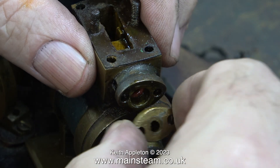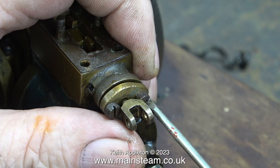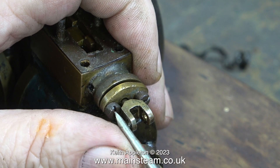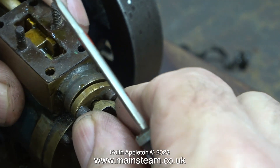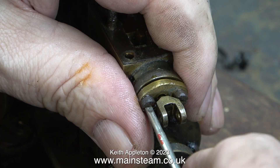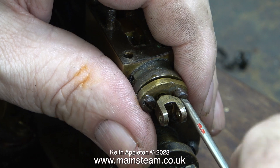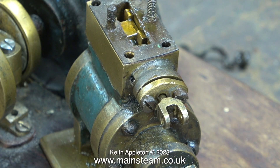As I mentioned in the previous episode, I would not normally even look at an engine like this. For the packing I'm using some o-rings. If this is not successful I will use some graphite yarn. In retrospect, wrapping graphite yarn around the valve rod would possibly be a better idea because it would support it — the hole through this unit is much larger than the shaft that goes in it. For the moment I'm going to live with the o-rings and see whether they work or not. Every part that I repair or make and fit to the engine has to be of the same manufacturing tolerance I'm currently having to work with. With the exception of the piston and rod, all of the components I'm using I'm hoping are going to be the original ones.